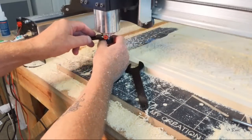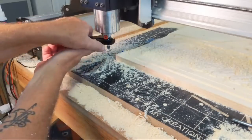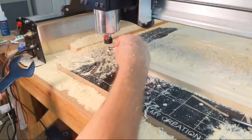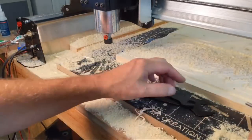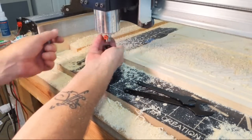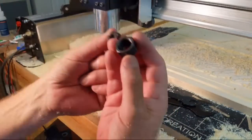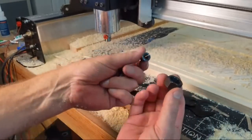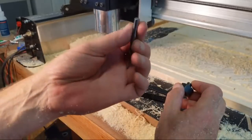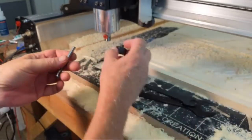So, I'm going to say this again for anybody else who popped in. About the red button on the Makita router, if you have a Makita router. Well, first of all, anytime you change your bits, clean your collets. Wood acts like a lubricant when it gets up in there. Also, clean your router bits. If, like when you get router bits from me, it has an oil film on it, you always want to make sure you get that cleaned up.